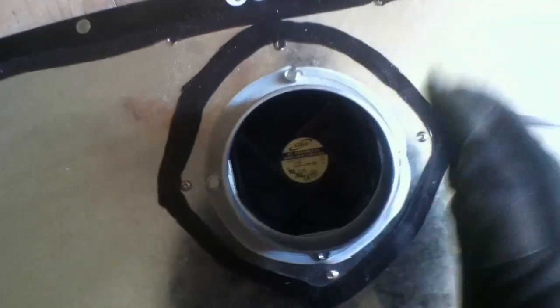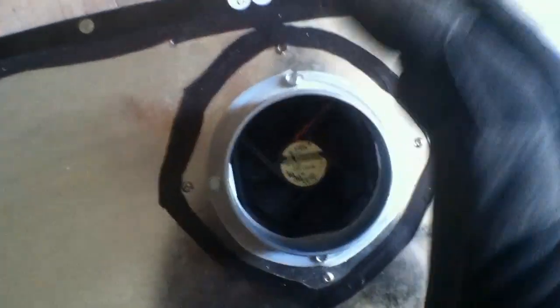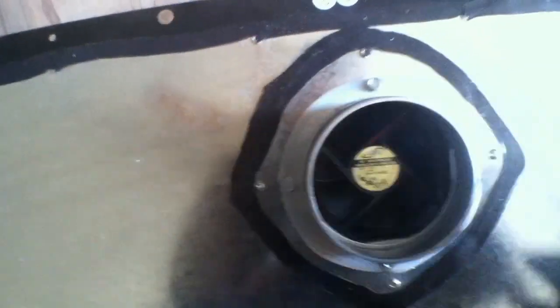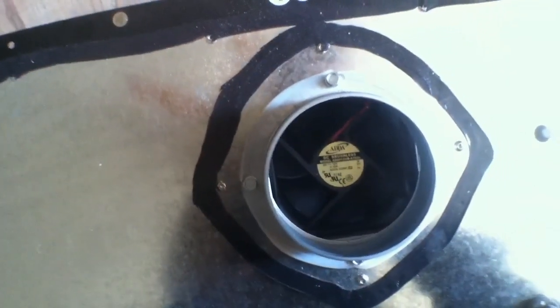Once you've got that in place, you're going to take the actual tube — I'll show you in just a second — you're going to mount that up on the wall and draw a circle around it. I've roughly etched that out with a pen. Here is the tube that goes through — that's the pass-through tube for the heat. Now I'm going to cut that out with a reciprocating saw, and then we're going to figure out our distance that we need to sleeve through.